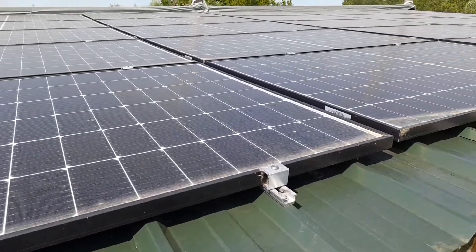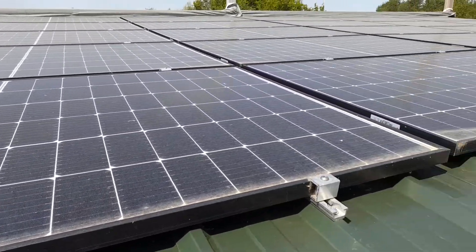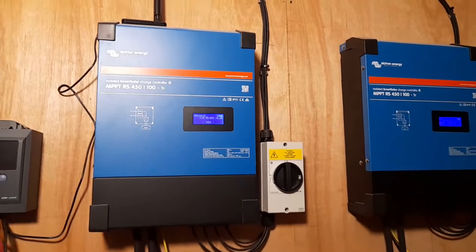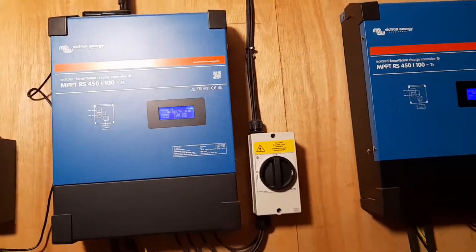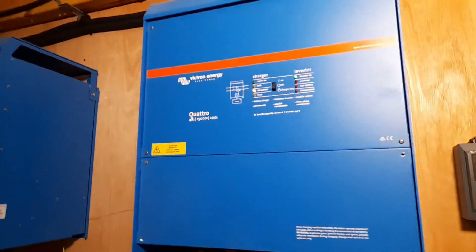As you may have seen in previous videos from the farm, I upgraded our system massively, which is why I'm an advocate of getting more than you need if you can. As you can see, we've got a 10kW array on this roof here, and down on our chicken shed we've got an 8kW array. That all runs into these big-boy solar charge controllers — basically a bigger version of what I showed you for the low-end system, but these are 48V, better quality, better brand. Because of that, they're more efficient, they come with ridiculous warranties, and it makes the whole side of the system nice and easy.